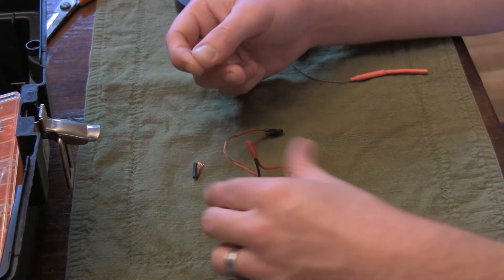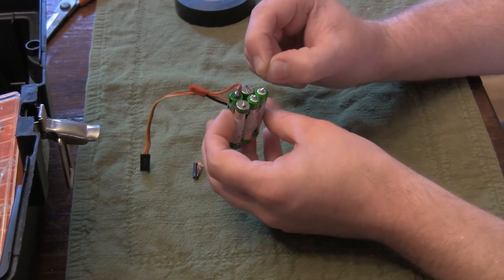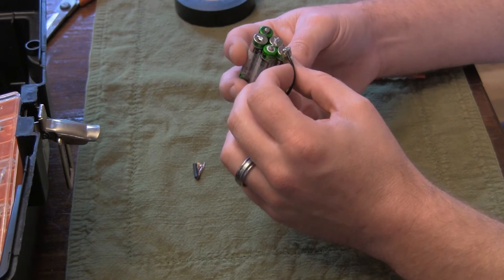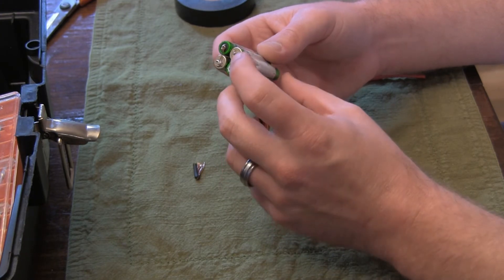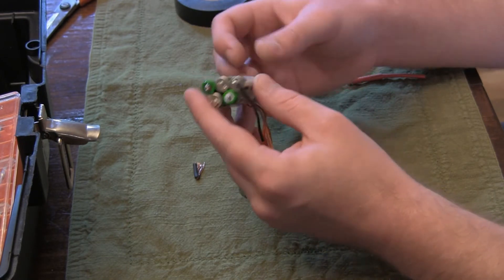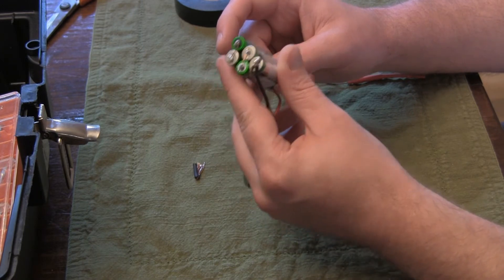What you're going to do is take a little piece of wire and get the right length you want — however long you feel you need it, long enough to go between two of the battery terminals. I'm not going to show you the actual soldering part; it would take a pretty long time. You're going to run these in series because you want to increase your battery voltage. Each one you run in series, you add the voltage on top. This is roughly 1.2 volts times 5, so you're looking at about 6 volts fully charged.